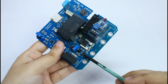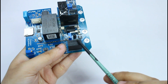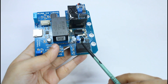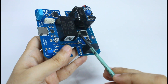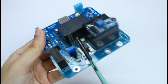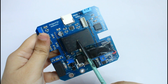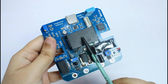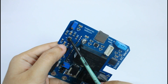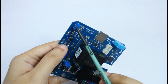The flame sensor detects flame or fire hazards near the device. A voltage sensing transformer steps down the AC mains voltage to a lower measurable level, providing safe isolation and accurate voltage sensing. The Hall Effect magnetic sensor detects magnetic fields, useful for sensing magnetic interference or anti-tampering applications. The AC-to-DC 5V converter transforms AC mains voltage into a stable 5V DC supply, powering the entire circuit safely. The LM358 operational amplifier amplifies the voltage signal for precise signal processing, and an adjustable preset allows fine-tuning of the voltage sensor gain to ensure accurate voltage measurements.